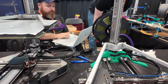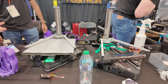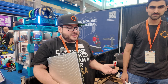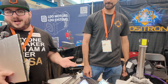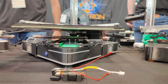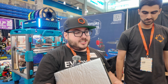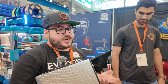We made the Positron bigger. This is the Proton or Anti-Proton. It is a 300 by 260 by 260 build volume Positron essentially. It uses H-Bot kinematics just like the original. We do still have the 90-degree hot end, but we are working on nozzle tap with Amplify 3D and LFOX. We're going to be bringing that tool head from the Proton to the Positron so you can get full nozzle tap and everything that goes along with a strain gauge on the tool head.